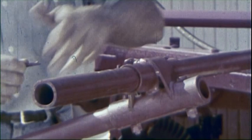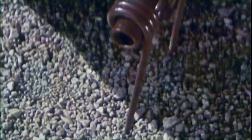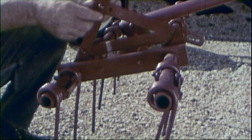It's so light, your tractor hydraulic system handles it with ease. It's made up of a series of 3/8-inch steel coil spring teeth that vibrate and rotate in freshly plowed ground to give the mulching action from which it gets its name. And it's as adjustable as all get-out.